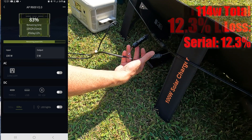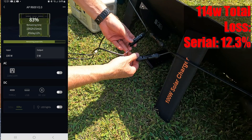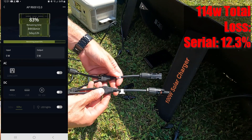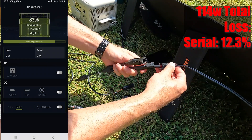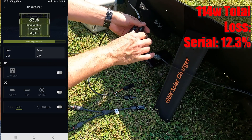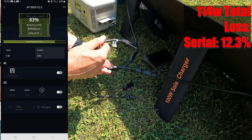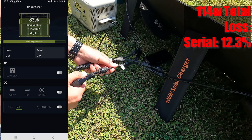I think the issue is I don't want them in series, I want them in parallel — that's what the issue is. So let's go ahead and disconnect this and connect it in parallel. I went ahead and bought some branch connectors so that way I can get my 114 watts. Let's go ahead and connect these up: this panel goes into this branch connector, and then connect the other branch up — there we go, now these panels are in parallel.